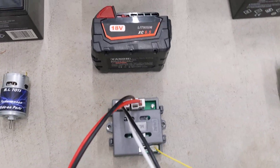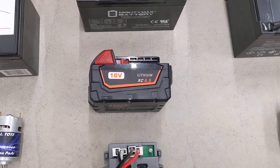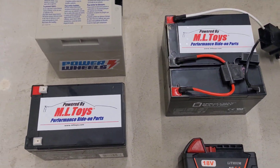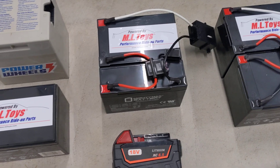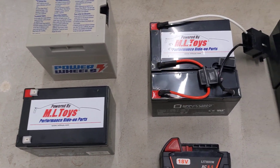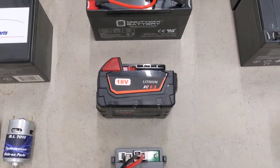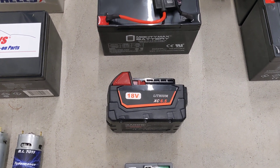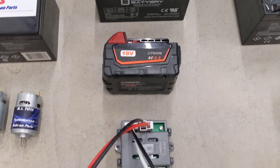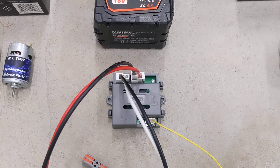The other nice thing about this: this is a cheap eBay battery and it does not have an automatic shutoff when the voltage gets low. A regular SLA — sealed lead acid — style battery, when it runs low, it's okay; the car is going to get slow and stop. When a lithium battery runs too low, it won't take a charge again, and in worst case it can puff up and burst into flames. So this module has a built-in low voltage cutoff that works for both 18 and 20 volt batteries.